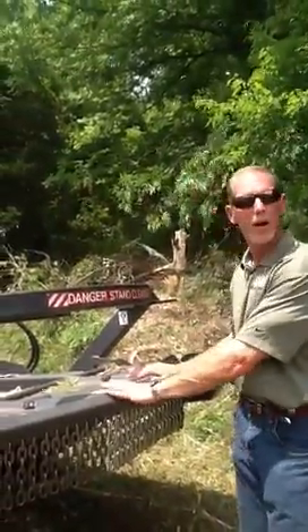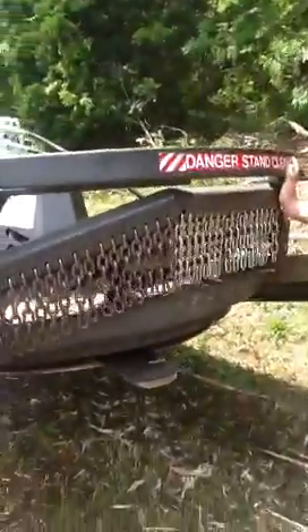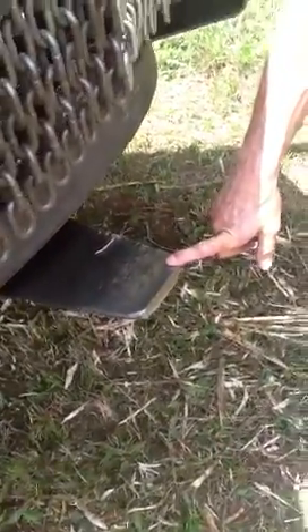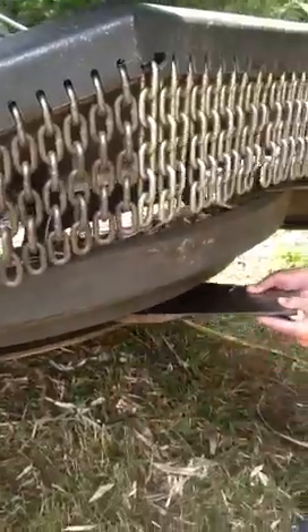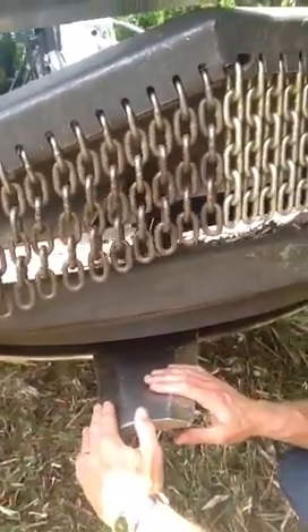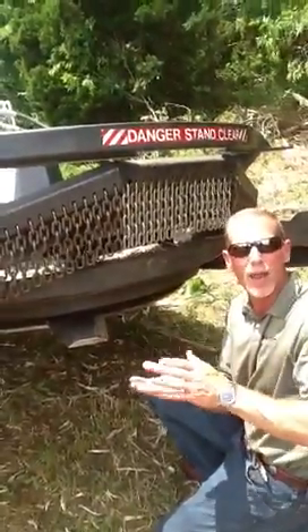This unit has a front door on it, so when you come into the material instead of having exposed blades, this slides up out of the way. What that does is expose four swinging blades that come out. These blades are three quarter inch thick AR400 abrasion resistant steel. One is beveled on the bottom, the next will come through beveled on the top, followed by bottom and top again. So what you're creating is an axe chop — you're never hitting the same spot twice. It's always chipping away at it.